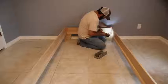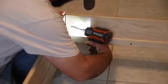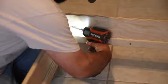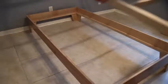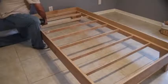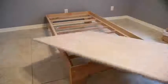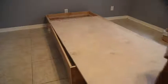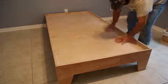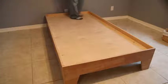This is something that will last you as well. These legs go together with just three pocket holes — really easy. With the support ledge on the inside of the bed frame, this is going to add a lot of support once you add in the lower support assembly. That lower support assembly rests right on top of that support ledge on the inside of the bed frame, and with a couple of screws on each side you're good. Then you can add the support panel — it has pocket holes on the top side, and you want to make sure it's seated nice and tight all the way down to the lower support assembly before adding the pocket hole screws all the way around.